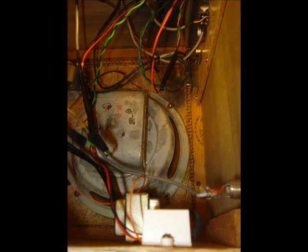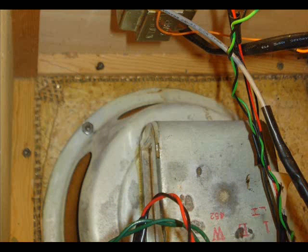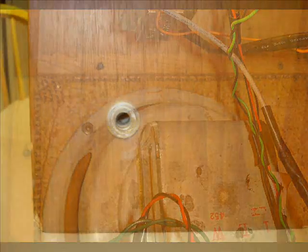And the actual reality of it is those karaoke machine speakers are tiny. They're little 3-inch, basically alarm clock speakers. So inside of this unit there was a transformer, and I just cut that in here. This is unusual for me to have something with a transformer inside, but I had enough room. And you can see there's also enough room I could add a spot to put in some D batteries, and I left those wires on the AC input jack. So if I do want to run this remote and have an internal battery hooked up, there's plenty of room for it in there.